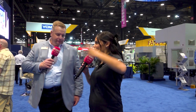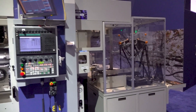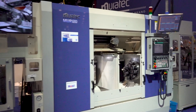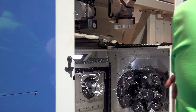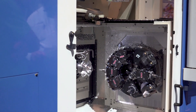A couple months ago we saw these machines getting ready at Muratech headquarters in Charlotte — it was amazing then, but even more so seeing them working here at IMTS with all the people around. The MWR we're showing is our twin spindle multitasking machine with auto loading. What's really unique is that the turret sits sideways, which allows us to have a Y-axis and a front load spindle, greatly increasing Y-axis milling capability compared to a live-tool-only machine. This is a development Murata showed a couple years ago that we're now expanding.